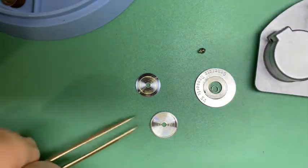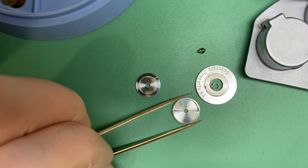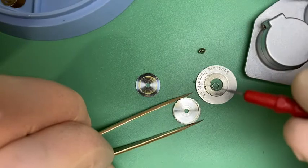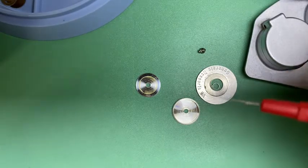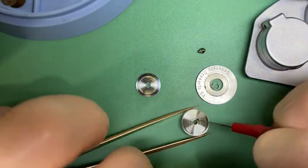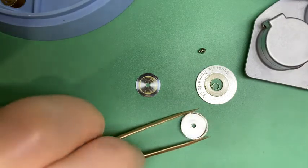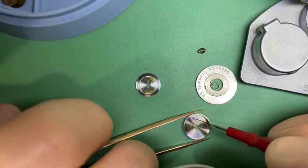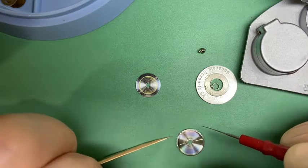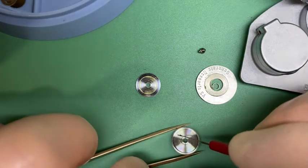The important part is the braking grease that goes into the barrel, which is the Kluber 125, which is what I use. It's a very sticky, thick black grease that we will put on the barrel walls. And as usual, we want it on the wall. We don't want it on a little piece of hair there, piece of metal. We don't want it on the barrel itself, on the base of the barrel,